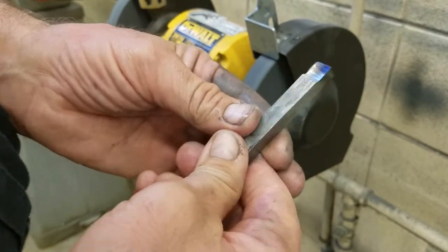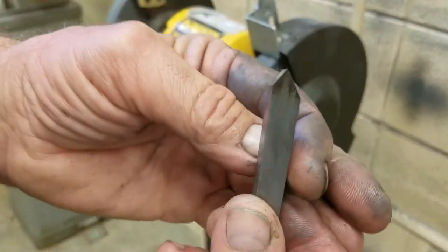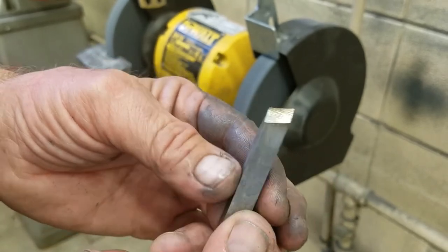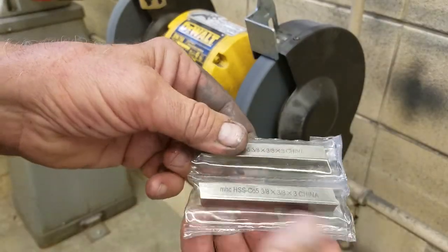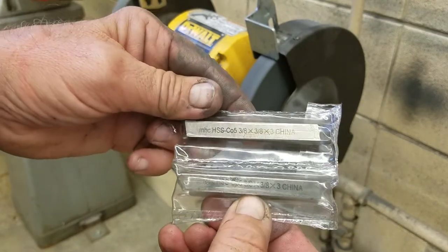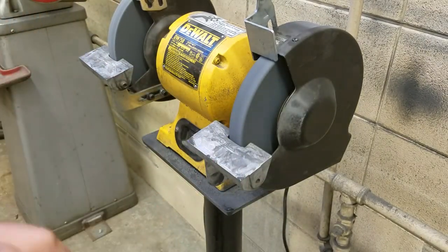So that's how we cut our threading bit and our grooving tool. If you have questions or need some tool blanks, I have a pile of blanks here — you can let me know and I can get them to you. These are 5% cobalt; the T15s are the best and 8% cobalt is absolutely fine. If you have questions or comments send me an email or a text and I'll get back to you as soon as I can. Thank you for watching.